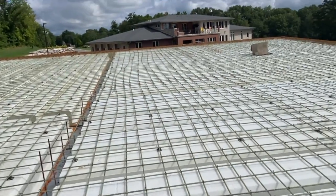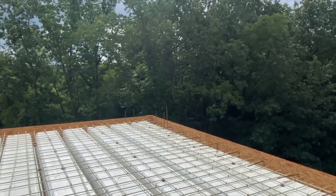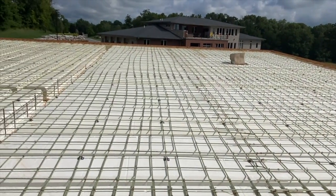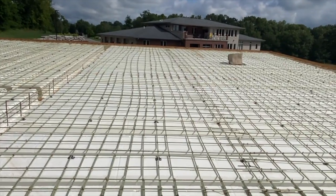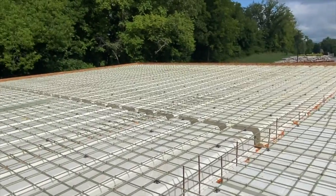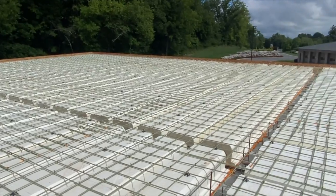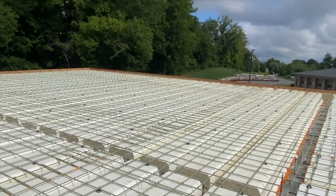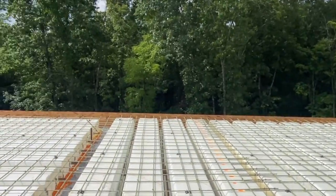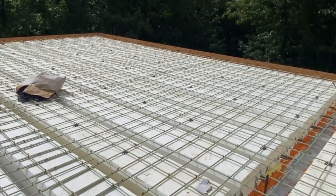When you want to do a deck up here, I've got a whole method for doing that. I'll link a video to my bison pedestals that we've done in the past on TPO. Not the cheapest way to go, but if you're going insulated deck or light deck roof, I don't think cheap is your main motivator. And I think the bisons and pavers is a really slick way to achieve decking. But like I said, this is more a bed for a bunch of solar, so we're not even worried about that. They make these little plastic pedestals for any equipment that we need to have up here that sits on TPO, kind of gentle.